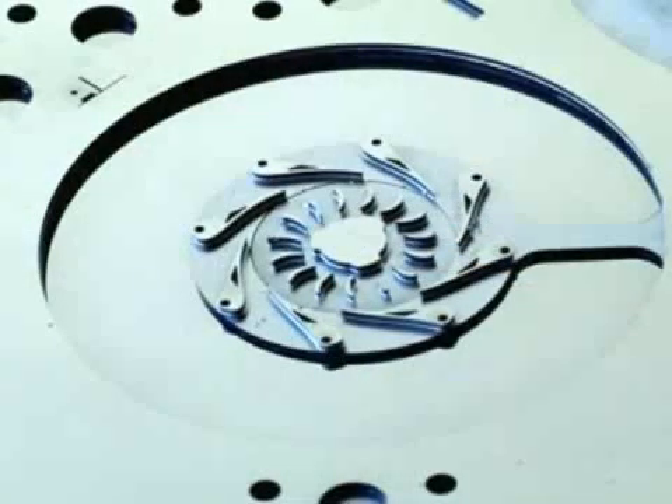What's being shown now is an individual turbine, focused in so you can see what we call the nozzle guide vanes — those little blade-like structures with little triangles in the middle, which are stationary — and those feed the flow into the little rotor in the center. You can see the very thin blades on the rotor, which would be spinning.